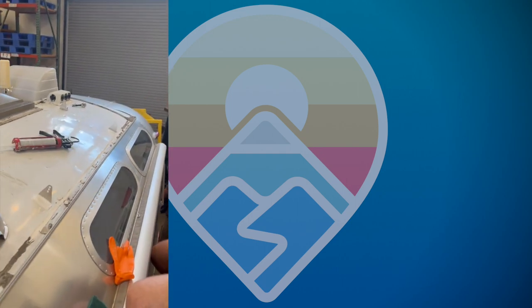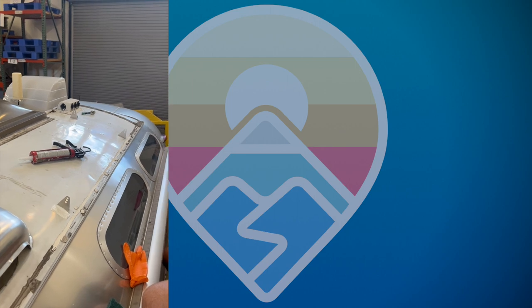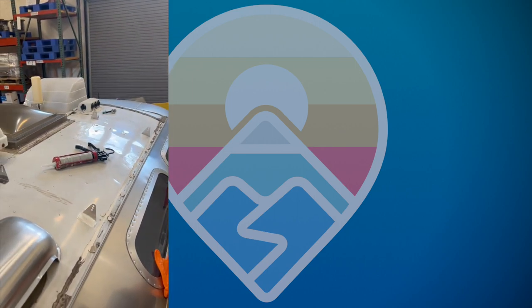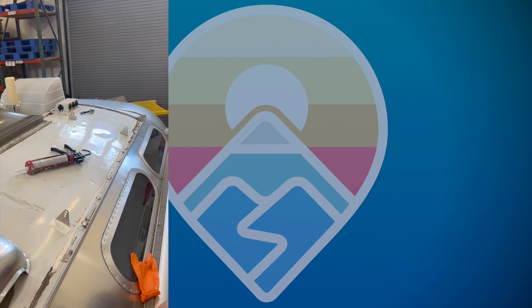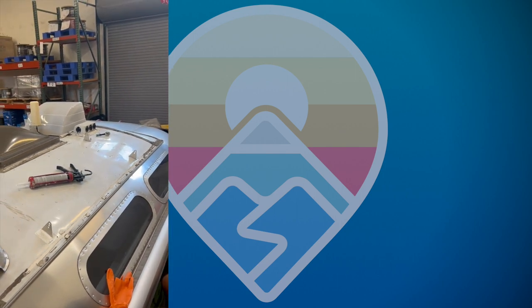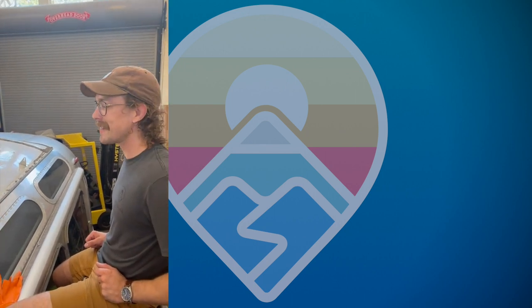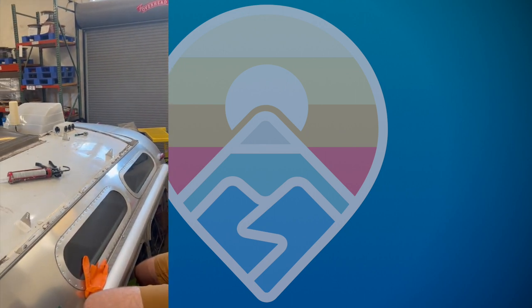After the SikaFlex is cured, you put the panels back on, bolt them down, route your wire harnesses to the combiner box making sure you don't have the polarity crossed, and then you're done with the roof.